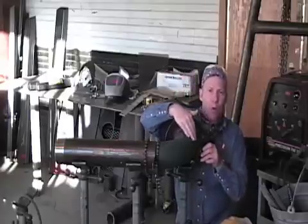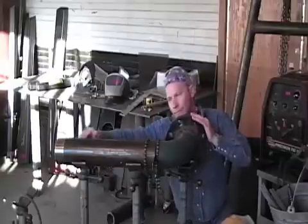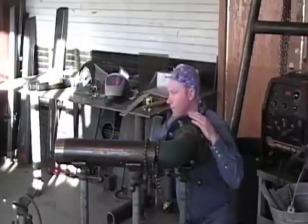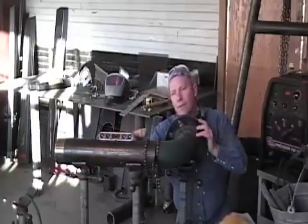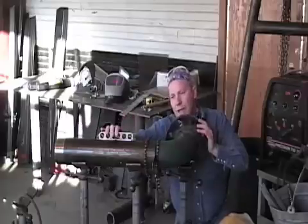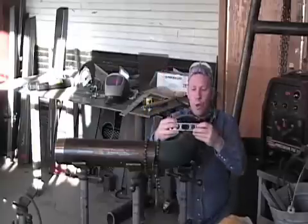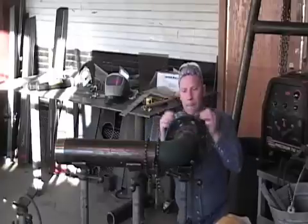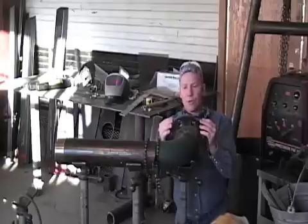So far I had my 90 welded onto my flange. My flange now is two-hole to the piece that I'm welding it to, which has threads on the end of it, unlike the other piece that had a flange on the end of it. I've got my torpedo level and I lay it down there and make sure that this plane is level. Then I can go ahead and check my two-hole right here. What you do is you line your level up with just an edge of the top of your two-hole showing, which I use all the time — this torpedo type level. I don't normally use two-hole pins, although they do make the job easier at times.